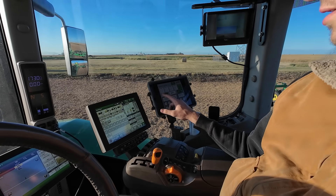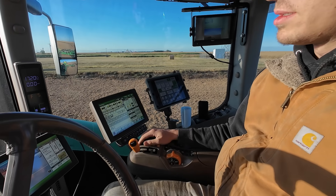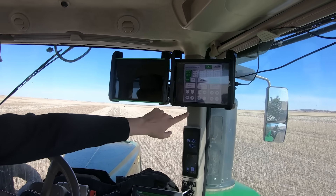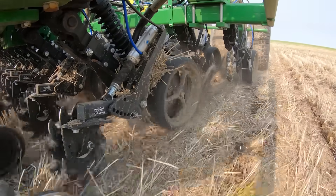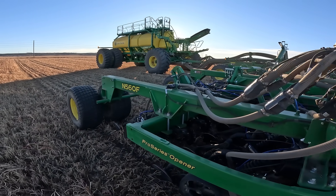To put the Yetter down, you just click the down button and that drops all the rows, then you put it in gear. Today it's just going to be a review of these row cleaners. I've got the iPad here, got it set the way I want it. We'll know when the crop is up exactly how well it worked — right now you know you're getting the seed-to-soil contact and doing a good job, but when it comes up that's really what you need to see. That's the goal of why we have these. Running it at 50 PSI.